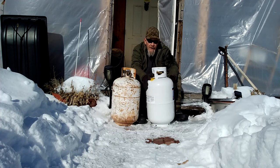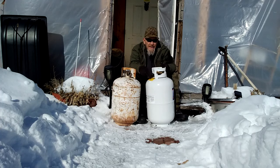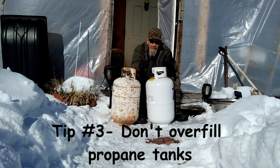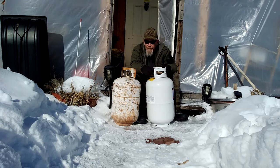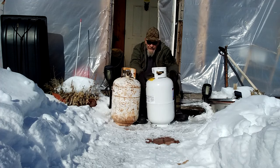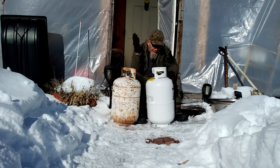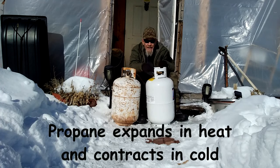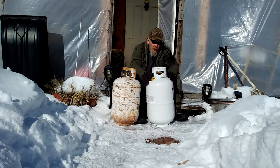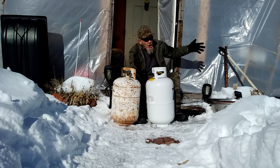This is a 30 pound tank, also called a seven gallon tank because when filled from empty you get about seven gallons of liquid propane. It's important not to overfill these tanks - they're designed to hold right around seven gallons, leaving enough room for expansion. In summertime, outside heat can cause these tanks to expand and they may release a little off-gassing. In wintertime, if it gets really cold, propane can contract enough that you actually lose some pressure in the tanks.